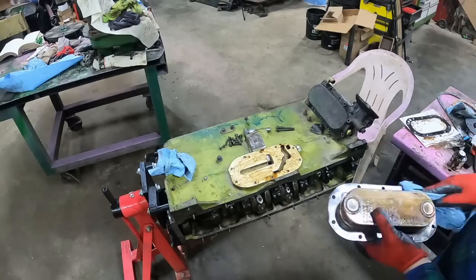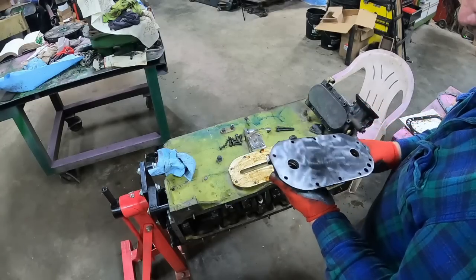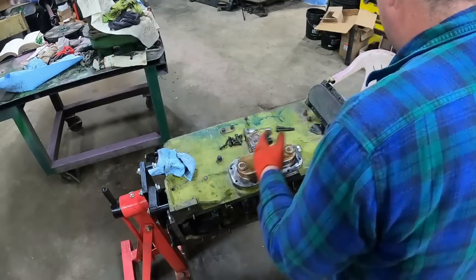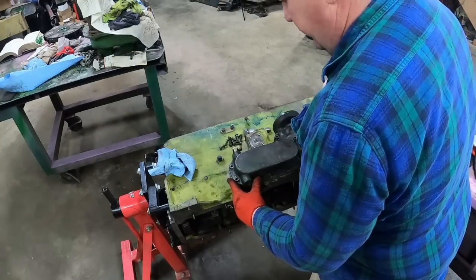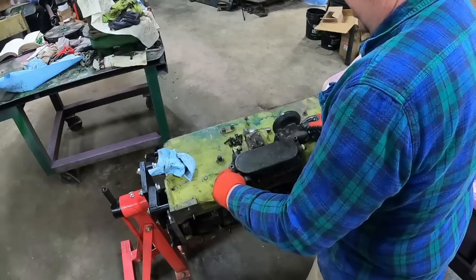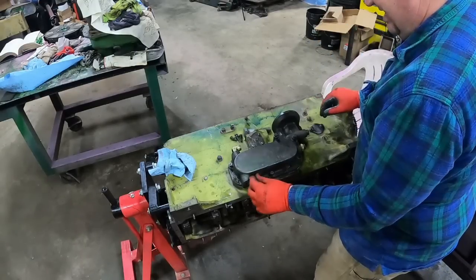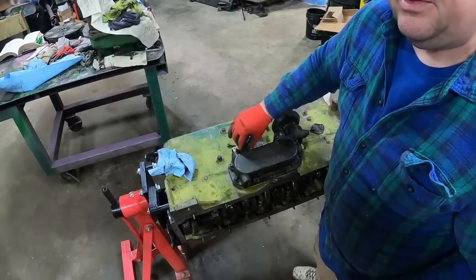Now everything's oily. Let's get this oil cooler on there. Got the oil wiped off after flushing it with fresh motor oil, so everything sticks good. Try to get it clamped down in short order, so if any oil decides to flow out of that cooler, it doesn't get on the gasket and make it less effective. There. I should probably put a plug back in that, because otherwise I'll eventually forget it, go to fill it up with coolant and wonder why there's coolant all over the floor.